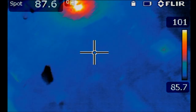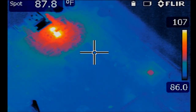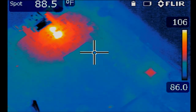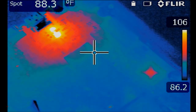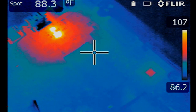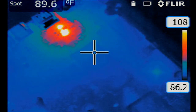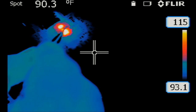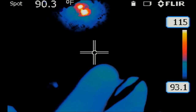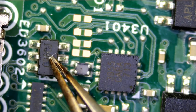We do see some heat being generated on the board. What's this? That could be our problem right there, because it's very abnormal for a spot to come on if the board is not turning on. The CPU is cold, and the board is not on. Something is blinking over there. Let me go to manual mode and raise the temperature. We have this component here and this component here. Let's take a look under the microscope to see what those components are — these are the two components that are getting hot.